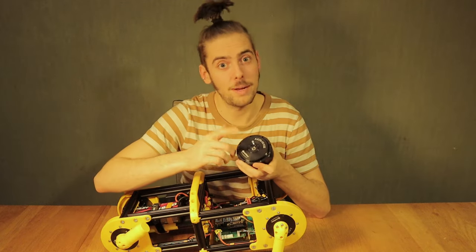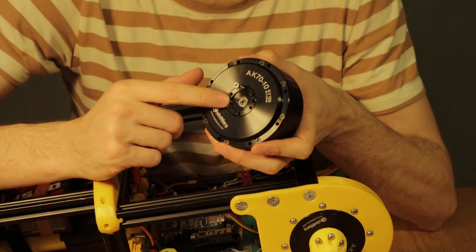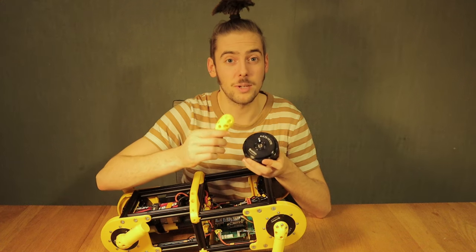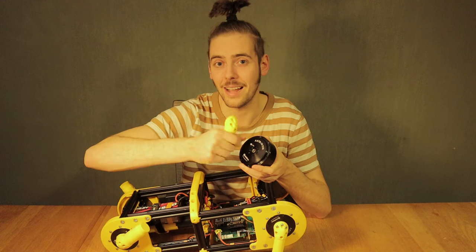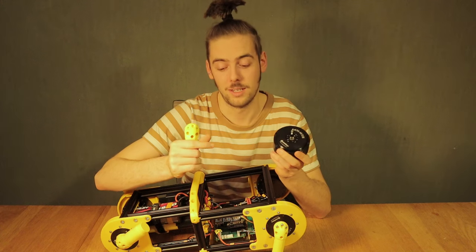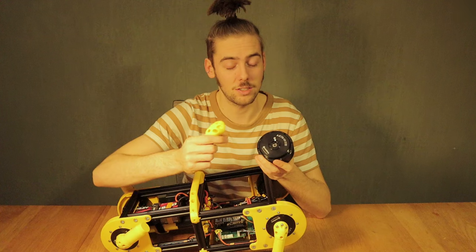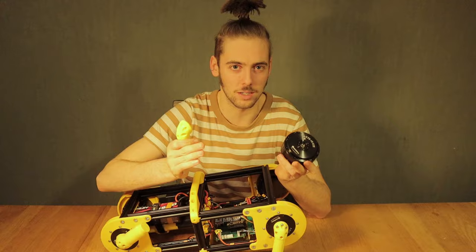My last challenge is with the mounting holes — they're very shallow and take an M3 thread, which is very fine. I want to mount 3D-printed arm connectors on them, but because the robot vibrates so much everything comes loose and I can't tighten them very well. I even tried securing them with permanent Loctite, but they still vibrated loose over time. Right now we're considering replacing the 3D-printed part with a metal part so we can tighten it more and the material won't flex as much, but I'm not sure yet if that will work.